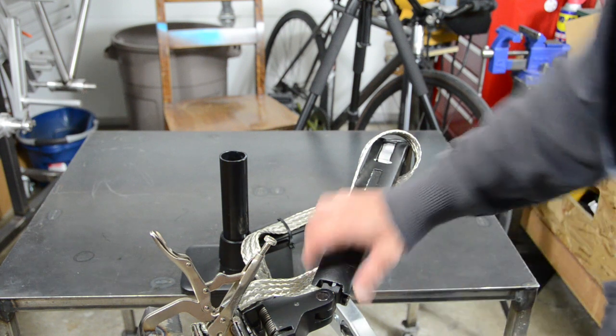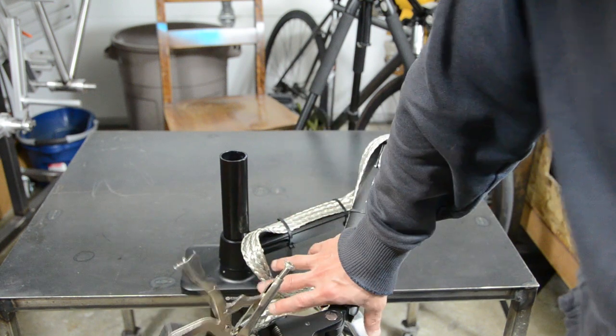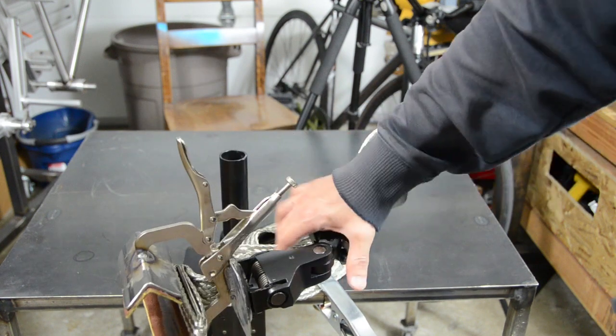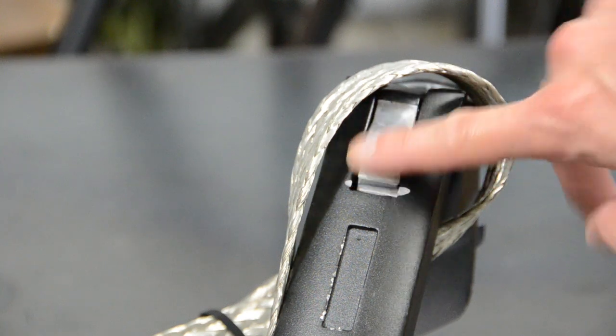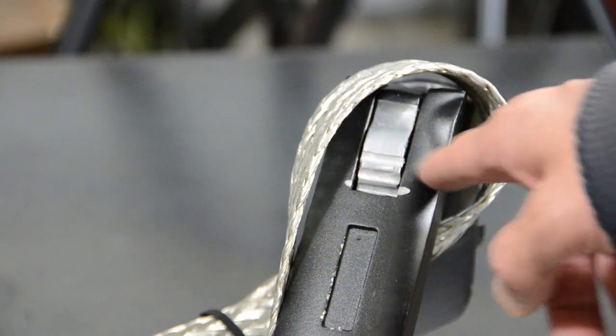Without grinding notches it's too springy and it won't stay down — it'll always try to spring back up to about here. Here's the top view: this was normally a smooth round brown circular thing, and there's a roller that normally rolls along this surface. As the roller gets lower, the diameter gets larger, pushing the spring. What I did was grind notches into it.